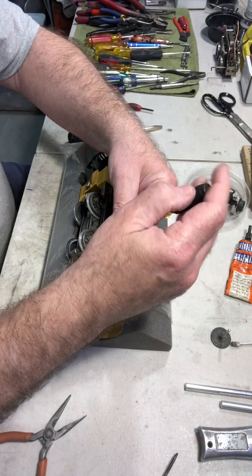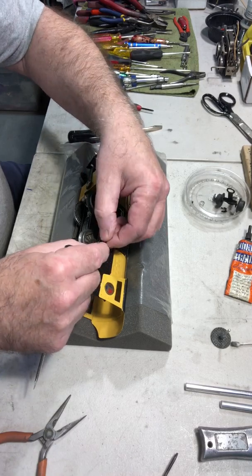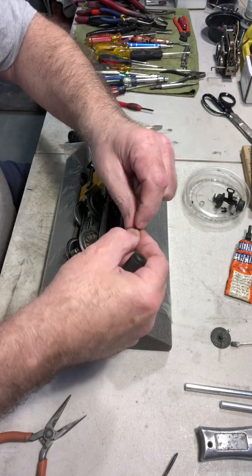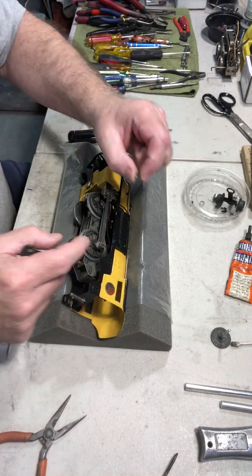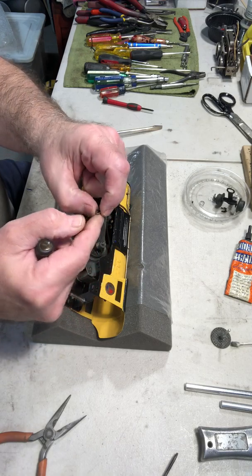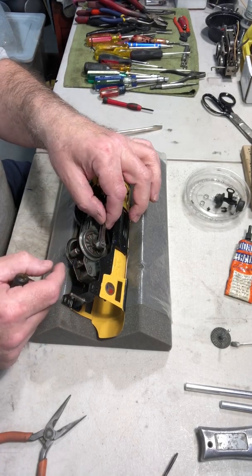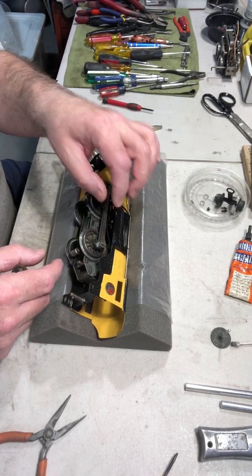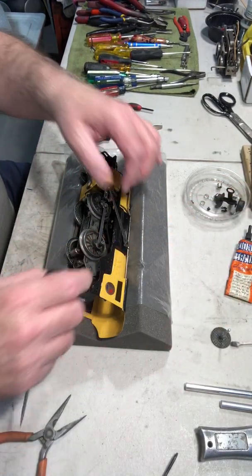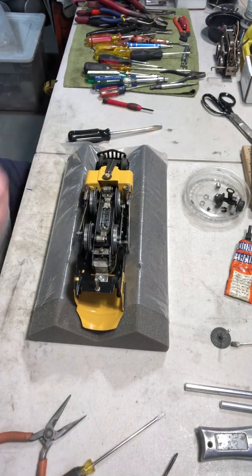I'm going to take this screw out of here, and there's a little washer that goes with it, and that actually keeps the drive rod, the main rod, on secure. And it has a little oblong hole in it. It's not round, it's actually squared on two sides, because the post is that way, and that's what keeps everything rolling snug where it doesn't flop around. So it's fitted for that reason. Take the spacer out. So that's freed from the steam chest and the slide rods.